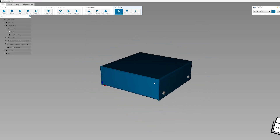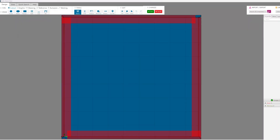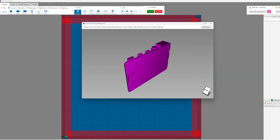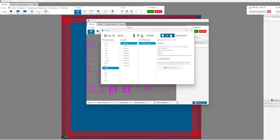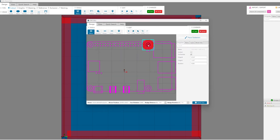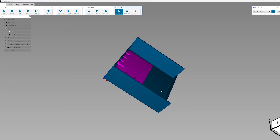Let's go ahead and edit the inside face of the enclosure to import our Raspberry Pi as an imported 3D component. Once we import the board, we want to select the face that will mate with the inside of the enclosure. Then we are going to place our fasteners — more specifically, mount the board with our M2.5 threaded standoffs and place them according to the outline of the component. Now that you see your board mounted inside, remember it's important to position the motherboard with enough clearance from the enclosure walls. Now that our Raspberry Pi board is mounted inside the enclosure and visible in the 3D Viewer, let's use the component projection feature to add cutouts for each board input.